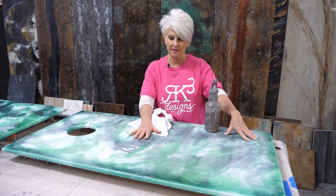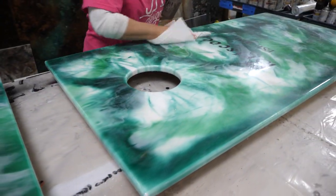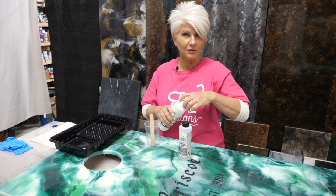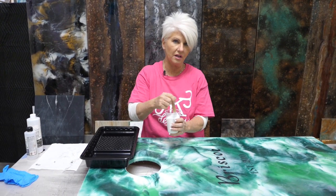I've sanded and prepped the top to get rid of all the very tiny imperfections. The sanding is also going to help the ultimate top coat grab hold and have good adhesion. For every four ounces of mixed material, you're going to add one cap full of water — the cap that comes with the bottle. So if I'm mixing up eight ounces at a time, I'm going to add two cap fulls of water. That's been the magic number. We've got our Part A and Part B. It's very important to stir Part A very softly — don't shake it really hard or you'll entrain bubbles. You've only got about 15 minutes to work with this product before it starts to thicken up.